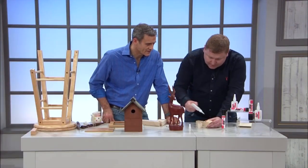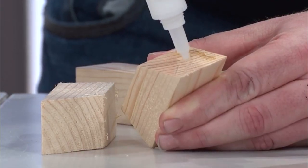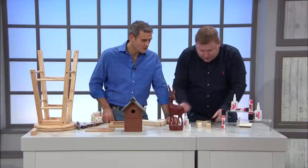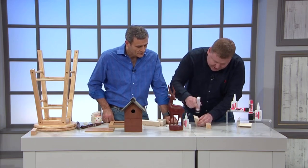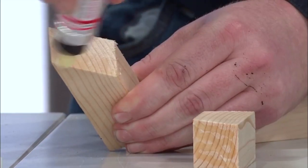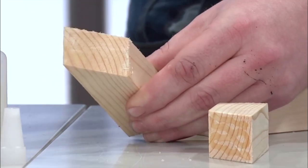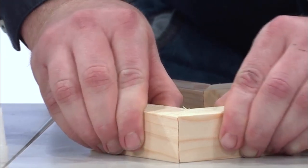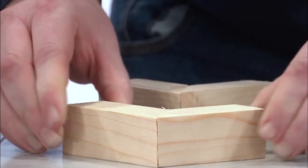Live in the studio with no safety nets — all we're going to do is apply some adhesive onto this timber, like so. This is what's called a contact adhesive, so you don't need to spread it — just leave it like that. It's not going to cure immediately, so you don't need to rush. With the activator pen, you go over the other side — it's like colouring in with a marker pen. Then bring both parts up and push them firmly together. There's no mess, no two-packing, no waste.